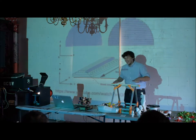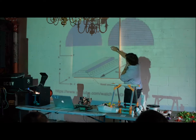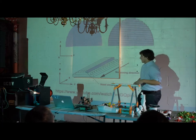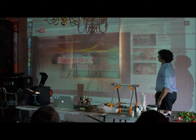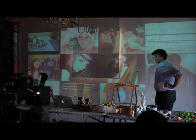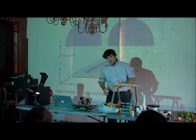This is an example of how you can make an object with curved surfaces — these are all solid lines but they're forming curves. You do this by creating thin layers that are very shallowly stepped, creating a sort of arc. There's a YouTube video here showing something being made as a timelapse — a princess bubblegum crown from Adventure Time — so you can get a better idea of how it looks when actually operating. That object probably takes closer to 30 or 40 minutes to produce. The printer runs fairly slow — these run about 15 to 30 millimeters a second.